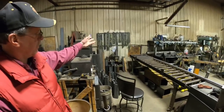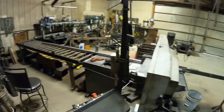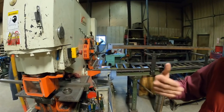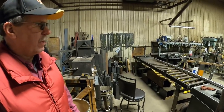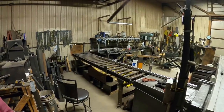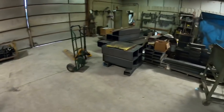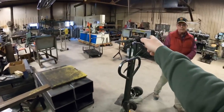The other door coming through from the outside is where we bring anything that needs to be sawed. That's where you get into most of your tubing — we actually do our bigger shafting through that saw too, because running shafting through the iron worker and shearing it distorts it, putting pressure and weight on it will bend it and cramp it up. So most of our shafting and all of our tubing comes into this saw. You can see some of the pieces we're sawing over there — big tubing.